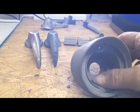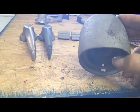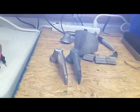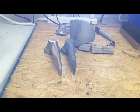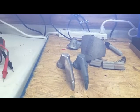But anyway, this is going to be totally re-sandblasted, and there are a few of these pits, like right there is one that's got to be drilled out. That black core has got to be drilled out. There's another one. There's a few there. A lot of work to get this done. As somebody said, or maybe it's in the Caswell manual, after you do a little bit of this, you understand why these people charge so much to re-chrome pot metal, because it's a lot of work, a lot of time. And so I'm anxious to get started and see if it really works.